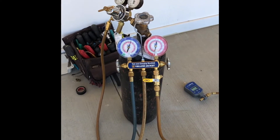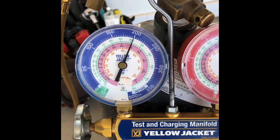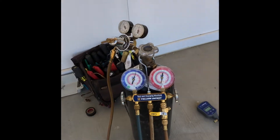Give it a little bit of time — 200, 350, whatever — and see if you've got a leak. You don't want to see even half a PSI difference, and then you can assume there are no leaks. If that gauge moves at all, you know you have a leak and something needs to be done.